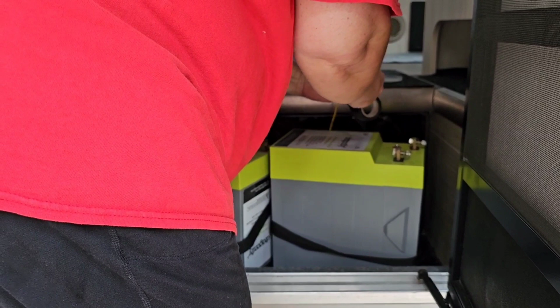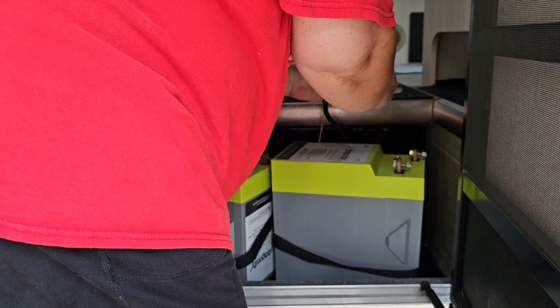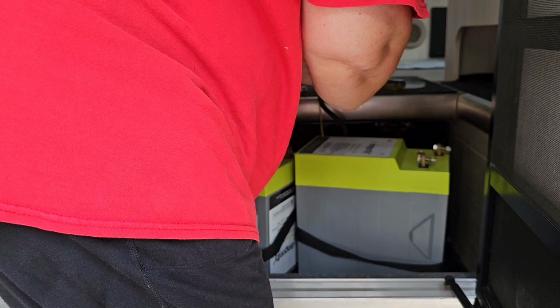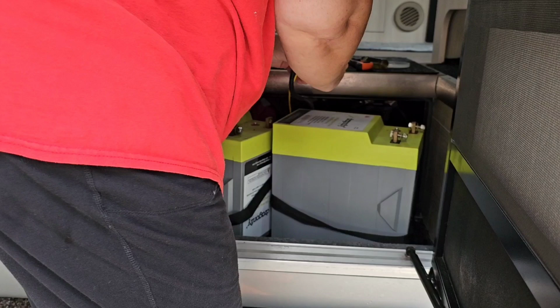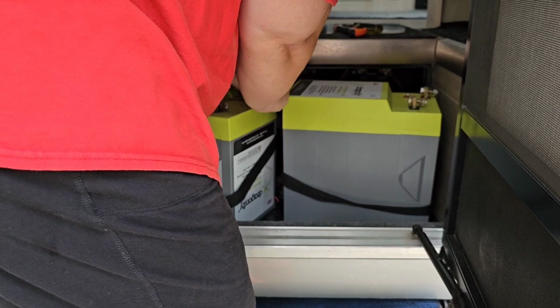There is an interior fuse for this power. I believe it's under the driver's dinette seat in the RL. So if you wanted to pull that fuse and completely kill the power, my guide gives you an idea of where that fuse is. But we're just going to be abandoning that in place because we'll no longer need it. It's all taped up so it's safe.